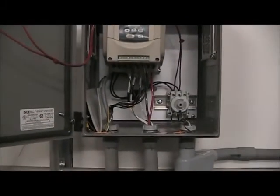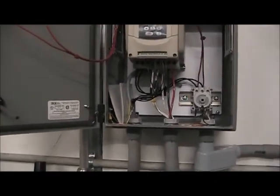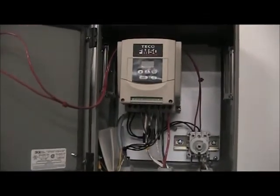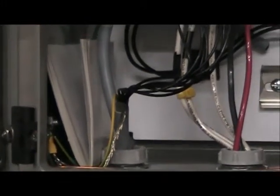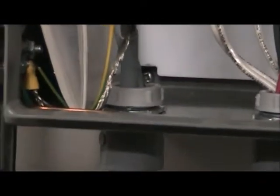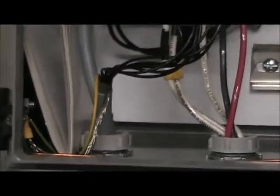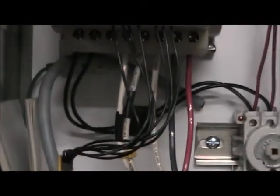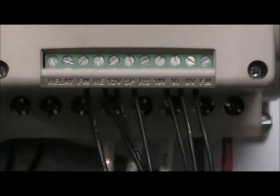I'm going to go into a little bit more detail now that I've got the actual wiring completed for the remote panel, minus the tachometer. As you'll see inside the FM50 control panel, I've got the different wires — I've got two seven-strand wires in there plus a ground and a shield. On this particular setup I've got the grounding wire and the shielding wire both terminated on the ground post, all tied into my ground. I also used that grounding post to ground out the lathe itself. On the front of the FM50, you can see all the different settings within the book.